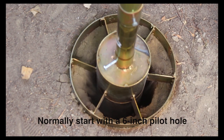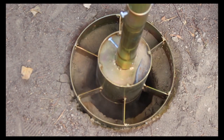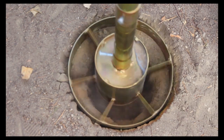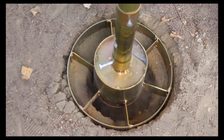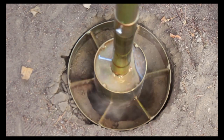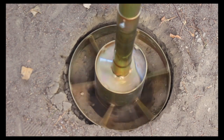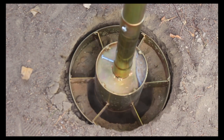As we're rotating this and the scraper blades are scraping the side of the hole, you can see the dirt falling down in the hole — this is the idea of reaming. Reaming a hole is a lot easier once you have the hole already done. Now we're going out to 12 inches and it takes a little more effort to get the hole going, but to dig a 12-inch hole from the get-go is pretty hard. I may stick the vacuum on here just to keep the dust down, and I'll pull this out now and let you see what this looks like.